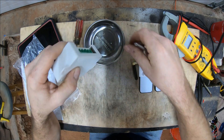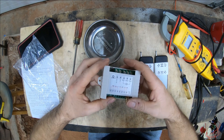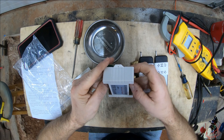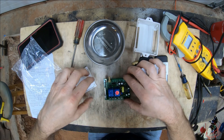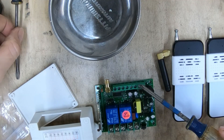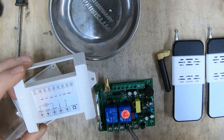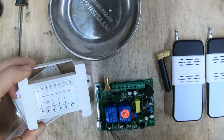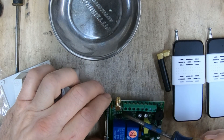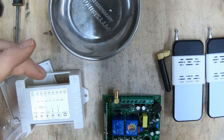Before you go and do this, I would suggest you open this up and look inside. Take the bottom off - here's the board. You have all these little terminals over here; don't use these, they won't help you. Stay on this side: you have a neutral, a line, a common, and a reverse. What's important while you're in here is this little jumper - you have L, S, and T - and I set it on L and S. With that, you're done.